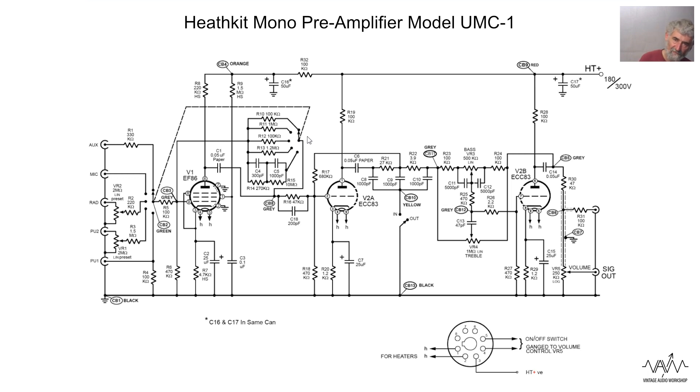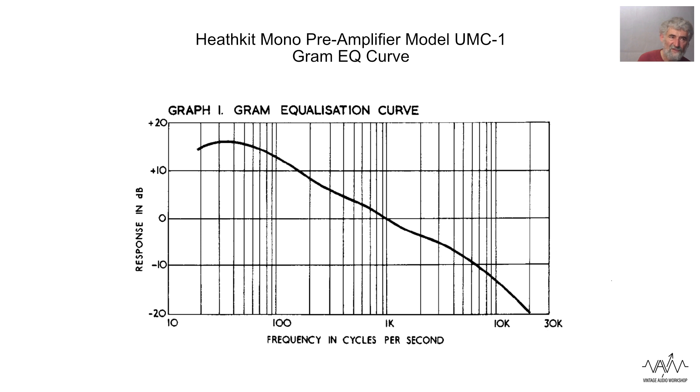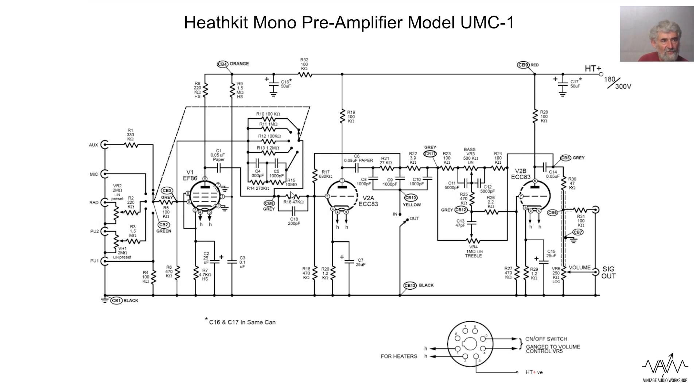There are two types of input. There are those that are flat - where one does not need to equalize the frequency response, only the level of amplification. And there are those for magnetic cartridge or tape head where you have to have frequency compensation. For a magnetic cartridge you need to cut the treble and boost the bass whilst leaving the middle flat. This is the standard two resistors each with a capacitor across it, which is switched in for that purpose, whereas the others are simply changing the gain.